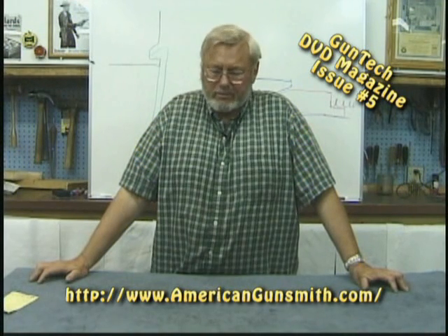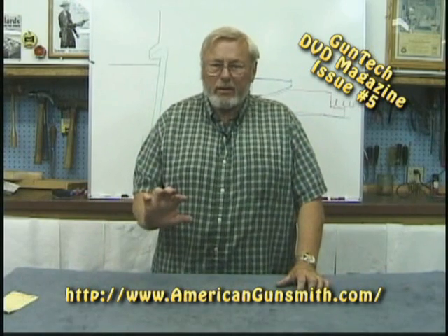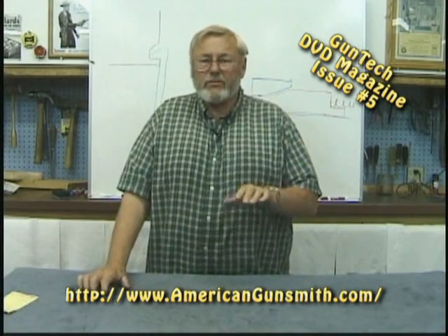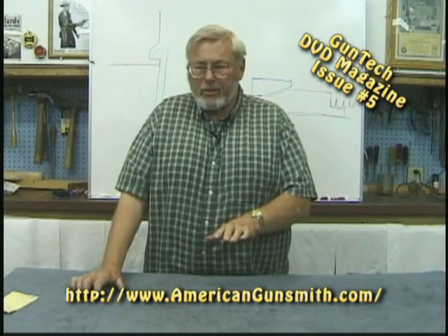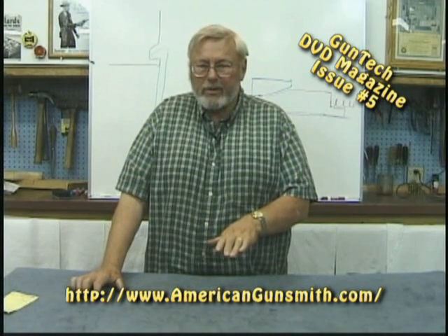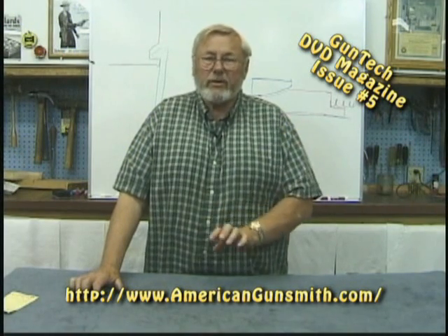Many military guns have rotating bolts, and on those guns, if the bolt rotates quickly — and they do when they unlock — centripetal force will have a tendency to lift the extractor up. So if the extractor has about as much weight in front of as it does behind the pivot point, the extractor will tend to stay there. If it has more weight behind the pivot point than in front, it'll tend to tip the front down and grab the cartridge harder. If it has more weight in the front, it'll tend to lift off and leave the rim of the case at a critical time when it must grab the rim and pull it out — it doesn't have a good purchase on it.